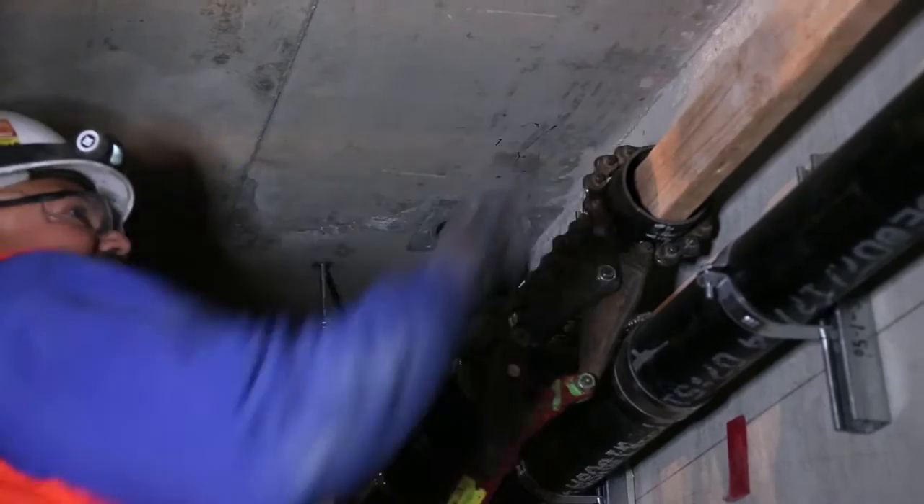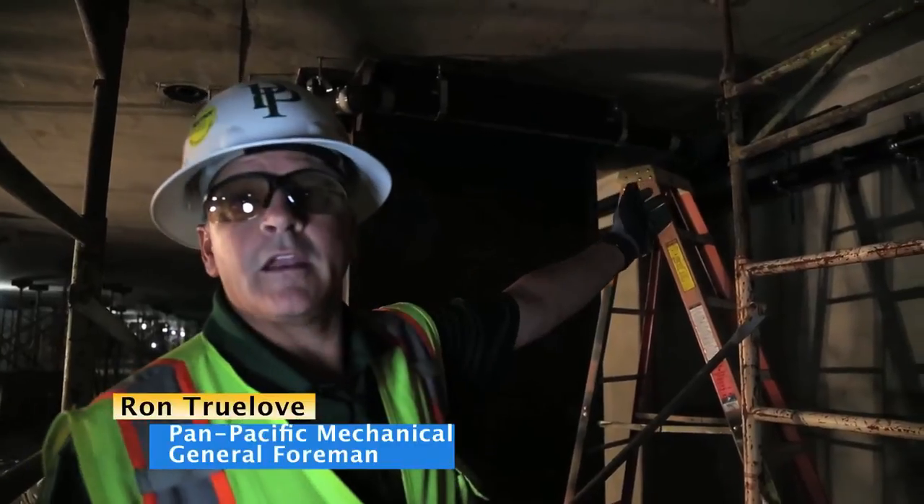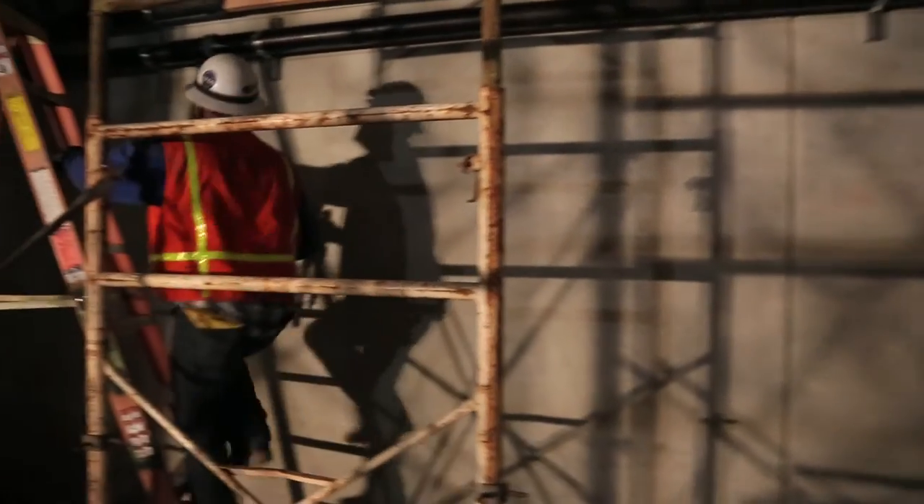Just a little while ago I was cutting the cast iron pipe, making it shorter, so that the bands would line up and everything looks aesthetically correct. This is a high-visibility area, so you want to make sure everything looks really nice when people walk through here. He was cutting off the end of the cast iron so that the bands would line up — we want to make it look uniform and neat.